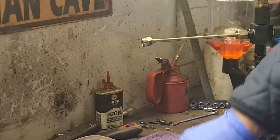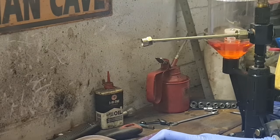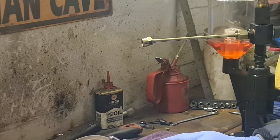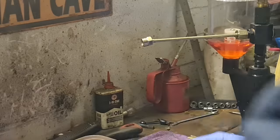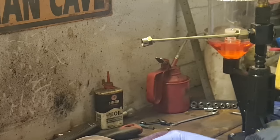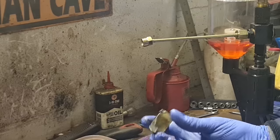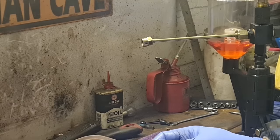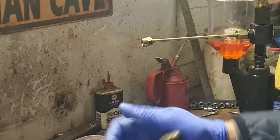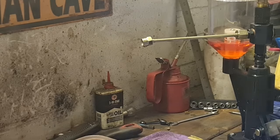While this was cleaning, I did take the liberty of cleaning out that injector hole on the engine, so that's clean. We'll reuse this copper washer — I've never had one leak yet, so that can be reused. Here's our top clamp. That doesn't fit over there very well — I'm sure that injector should slide over there. Oh no, it does go on — it's just a bit tight. Right, let's get back out and get this back in the engine.